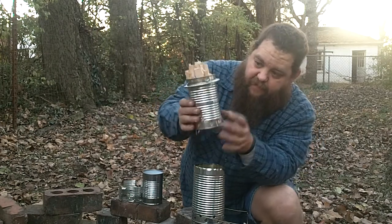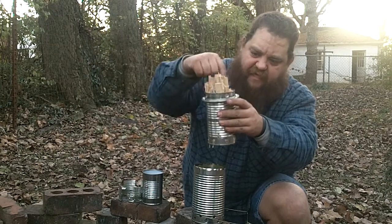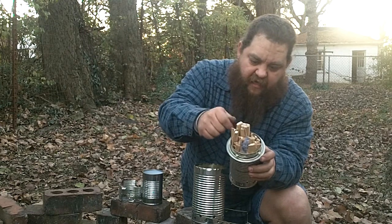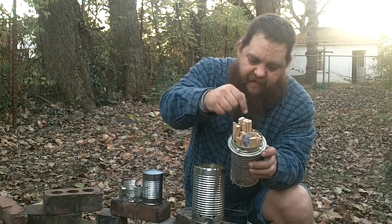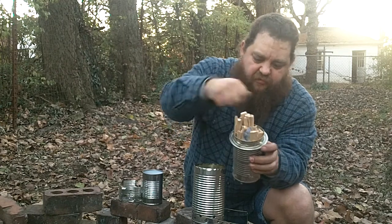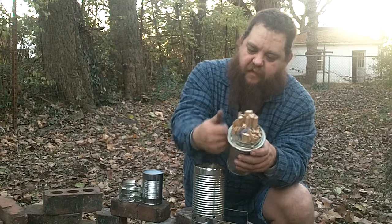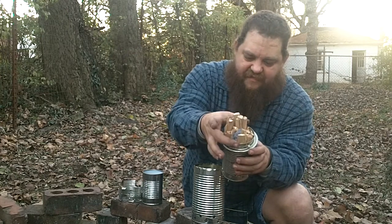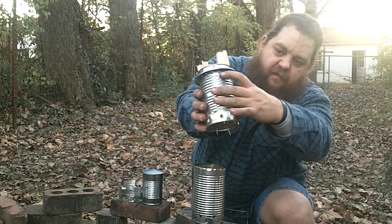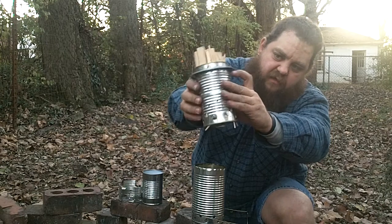And then under the lip here, I put the lid, I scribed this can on it, and then I took a nail and I just made holes all the way around it. And then I took a small width chisel and I chopped it out. No, I didn't use any power tools for that. And then I just took the chisel and I rounded the can so it would snap over this. 3/4 of an inch down are these 1/8-inch holes. There's 16 of those that go all the way around.